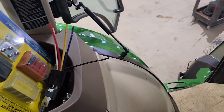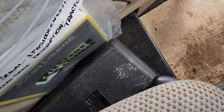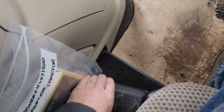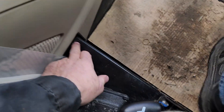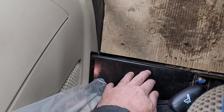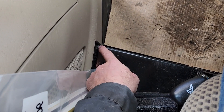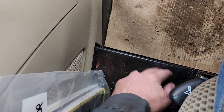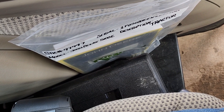A couple other small items I want to tweak on here — I've got the toolbox that came off the front fender. I'll show that in other parts, but I'm going to put it to use here because it seems like it fits right in this area. I can put a few tools in here — some of the nicer stuff you don't want to just leave out. I need to put an aluminum angle all the way across this edge here. That's going to keep anything you put in here from sliding out. There's absolutely nothing underneath this metal plate, so I'm just going to put in a couple of quarter-inch nutserts, put a little aluminum angle, and bolt that down. That way whatever you set alongside your seat isn't going to be a safety hazard and bounce out onto your feet.